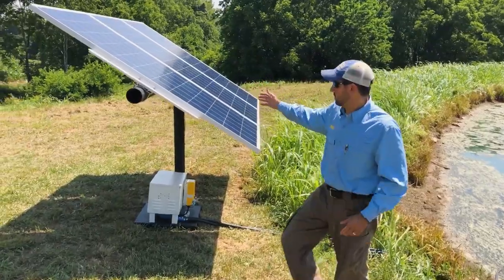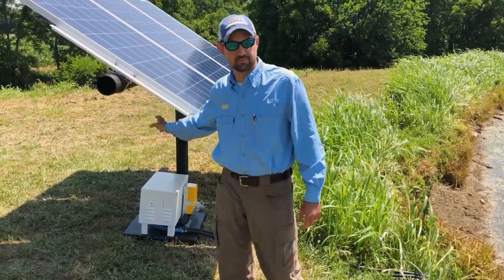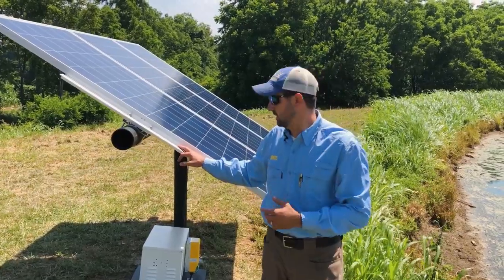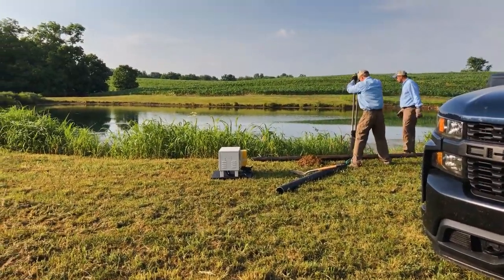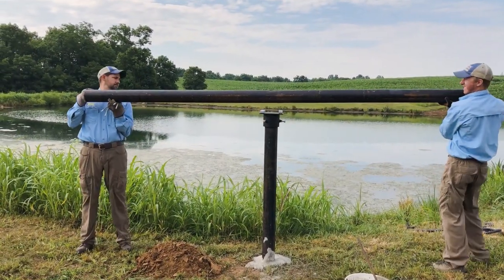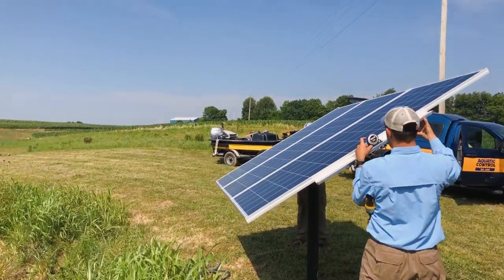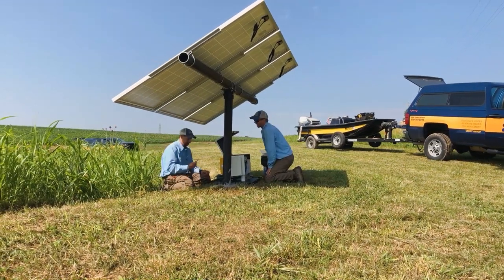This is a three-panel system — we've got three solar panels up here and a quarter horsepower electric motor. We've got four-inch nominal steel piping that we've concreted into the ground. A few really important things you have to do right at the beginning for a smooth install: the pipe needs to be deep enough — we've got three feet in the ground, concreted in to keep it from heaving and thawing in the winters. Everything's perfectly level, and the solar arrays are facing dead south — that's very important. Depending on the latitude of your installation, you need to set the angle toward the southern sky just right. We're at about a 34-degree angle here, which is right for our latitude to catch the most sun and maximize the output of the solar system.